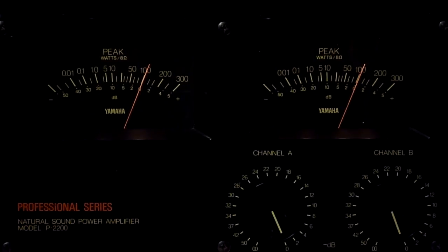There we go. Perfectly adjusted meters. Just had to pop the top cover off and give two adjustment potentiometers a bit of a spray with my DeoxIT, and the meters seem to work just fine off of that.